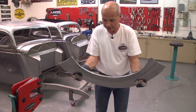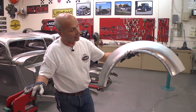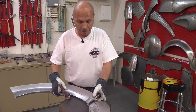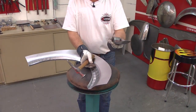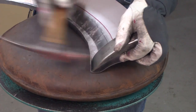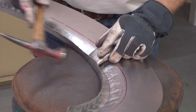If the panel is a little twisted you can always bend it by hand and do some modification, or go back with a rubber band in the English wheel and roll it. This is the flange I'm looking for. I can show you one more thing — to bend this just a little bit more so the flange doesn't show, we go over to the sandbag. I'm using the sandbag as a working table. I'm using this type of dolly that I flame-cut probably 25 or 30 years ago and I still use it. I like to have support down in the corner.